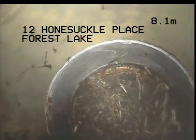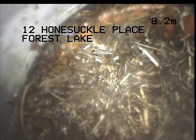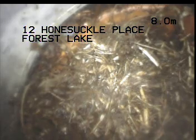Okay, so I'm at 7.9 metres. I'm at the bottom of that invert again, and I'm working my way around. I was able to get my way around the bend there, and that's the connection to the sewer that I can see there. That's actually the inspection before the sewer at the bottom of the invert, so we're at 8 metres. Now I suspect it's possibly just the root ball from when I'd cleared the drain. I'm pretty sure that's just the root ball that's gone down, but I'm just going to run the jet through one more time and see if I can get rid of that, just to be sure of what's going on.